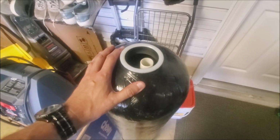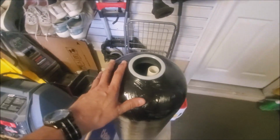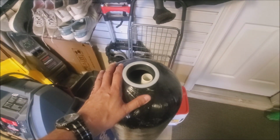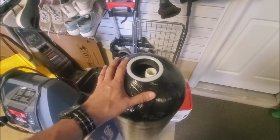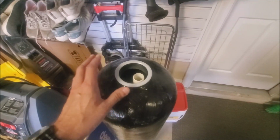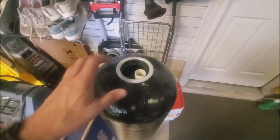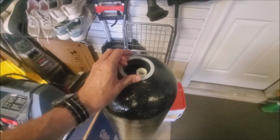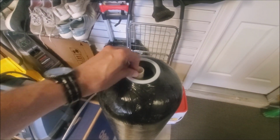If you have to rebed your water softener, which you would do if, for instance, you turn on a faucet, you have good flow, and then the flow just starts decreasing and goes down to maybe a trickle, that's probably your resin going bad. If you put your water softener in bypass mode, then you'll be able to know for sure. If you put it in bypass mode and your water pressures are fine, then yeah, your resin has gone bad and you need to rebed your water softener. There are other videos out there about doing that. Maybe I'll do one too, I don't know.